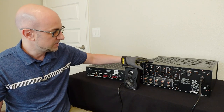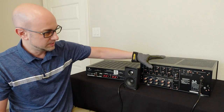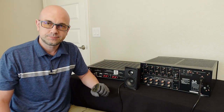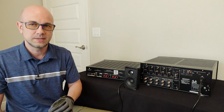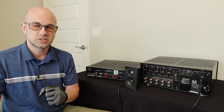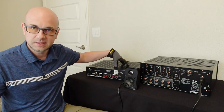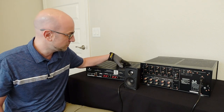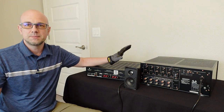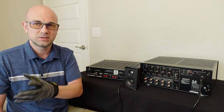Let's say the preamp does a total of seven channels — this is a five-channel amp and this is a two-channel amp, so you could potentially use one of each. Or try to find amplifiers of the same brand with a similar tonal quality so the speakers don't sound too off. Unless your speakers are very bright-sounding — in which case you could use an amplifier like this that's very warm-sounding, which can help compensate and make those speakers sound pleasant.